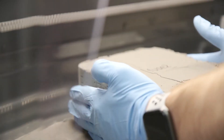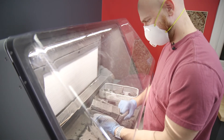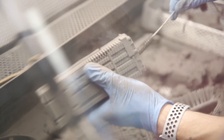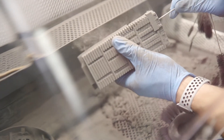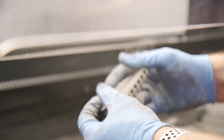First thing I do is slide the entire cake over to the white grate. Any loose powder that falls into the sieve will get recycled. What I like to do is use my hands to separate the larger pieces and then work my way down to the smaller ones. Make sure to use all the tools that come with the sift to clean the inside and outside of your parts. Any airborne powder will get captured by the filter due to the negative pressure in the sift.